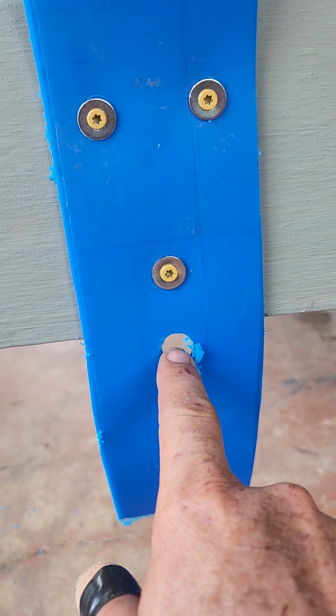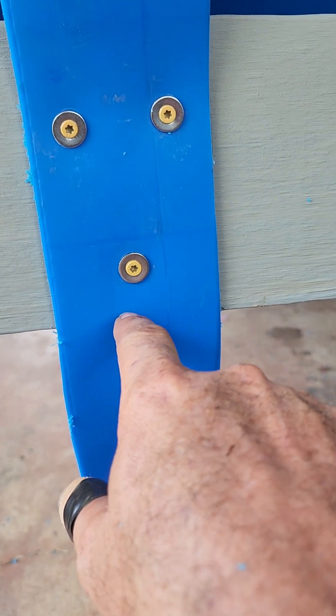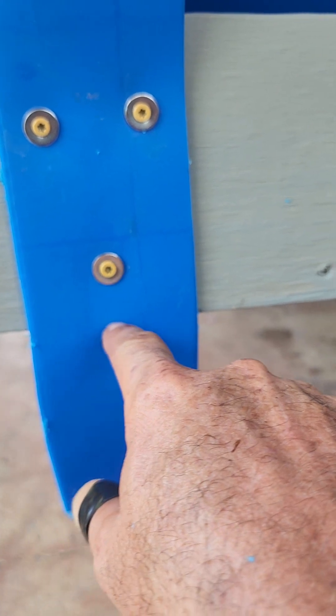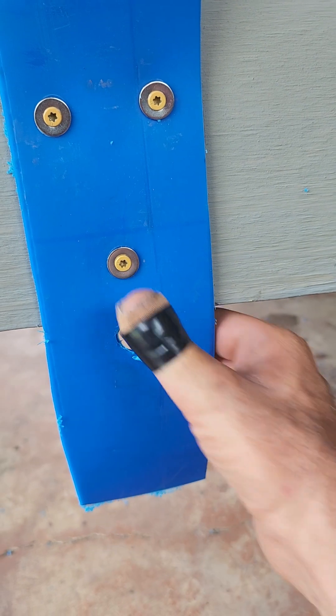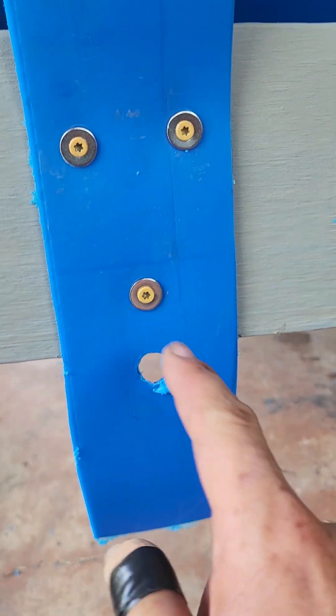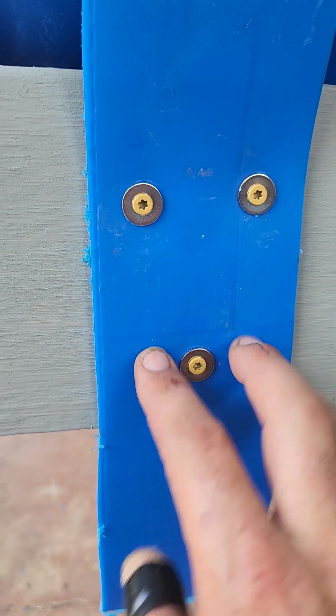This is a half-inch hole. I drill my hole where this 2x6 line is, and I stick a screwdriver in there and pull down — it tightens the strap down. Then I put this one screw and pull the screwdriver out, and the strap stays.